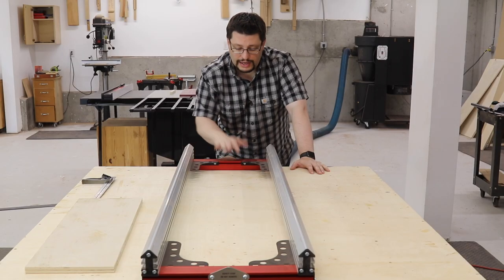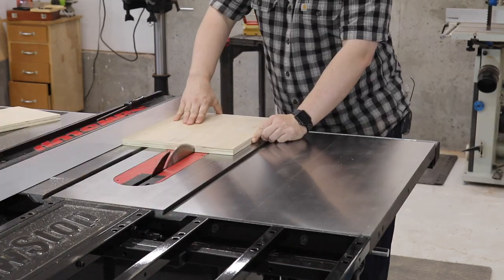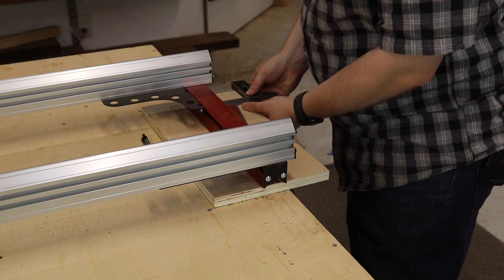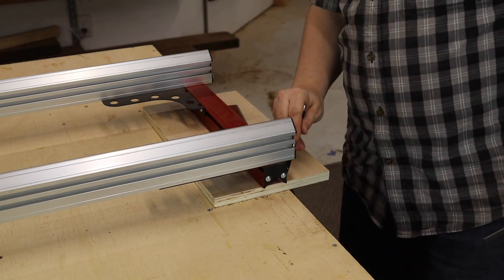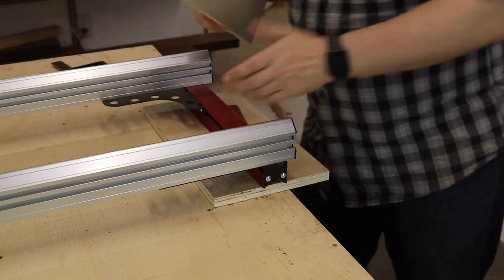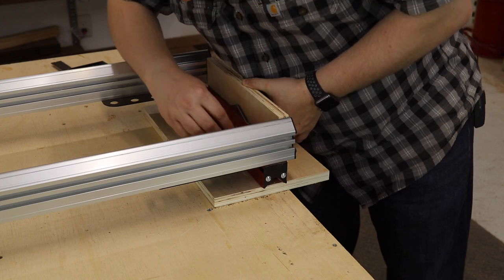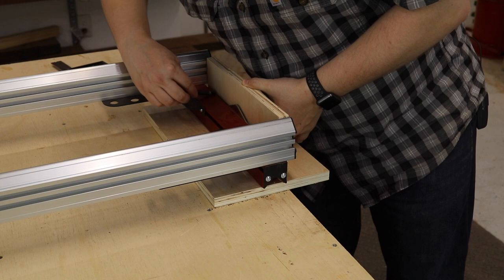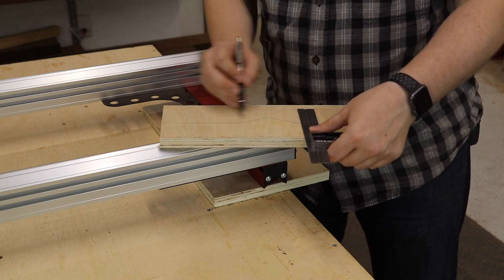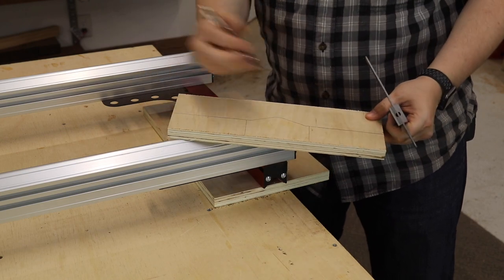Now I want to create pieces to help hang the sled for the router mill. I'll cross-cut two pieces to fifteen inches wide, then rip them both to eight inches in width. I took one piece to the bottom and set my square to three-quarters of an inch from the bottom of the red aluminum to the bottom of the piece. On the other side I made it three and a quarter inches from the top. I had two leftover pieces of plywood that fit nicely between the two rails and transferred a line — right at the end of the red — coming out about a quarter of an inch where it dips in.